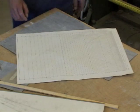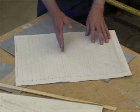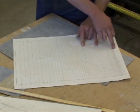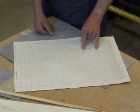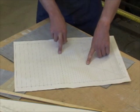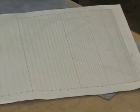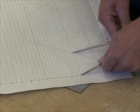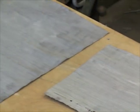The scale of the pipe is drawn onto this sheet, which has lines in logarithmic progression — low C, tenor C, middle C, and so on. The bold lines are the C's. I establish the circumferences of the pipes on the C's and then connect those points to establish the circumference of all the rest of the pipes. That's how I'm going to size this particular pipe — the C above middle C.